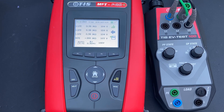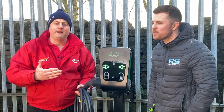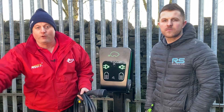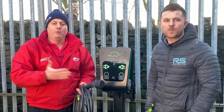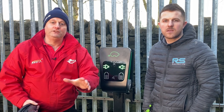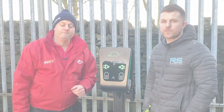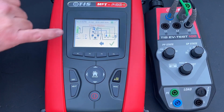At this stage it's worth emphasising that continuity and insulation tests are really important — for a tethered unit, those leads lay on the floor and get run over, so the test from the tethered lead to the unit itself proves continuity and insulation. For an untethered unit, ask the customer for their lead and perform the test on it too, ensuring continuity and good insulation. It then moves on to the next sequence: the status check.